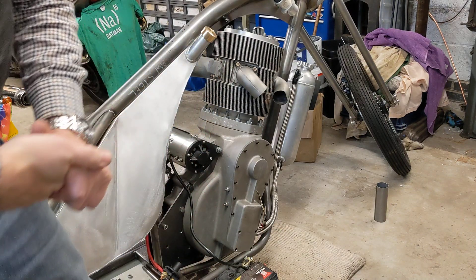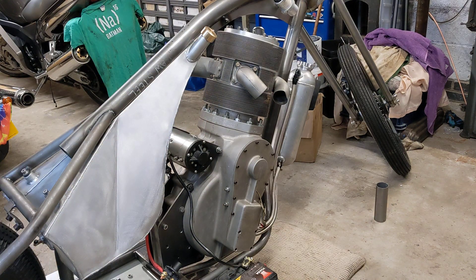Plenty of speed there, and in the future if we fit the slightly larger sprocket on the dyno start we can perhaps get even more rotational speed. When we snap the decompressor there should be enough inertia to take it over the top and start the bike.